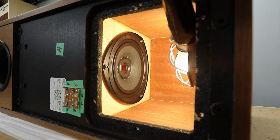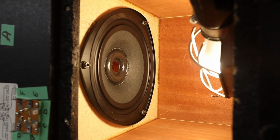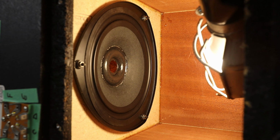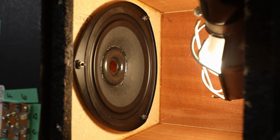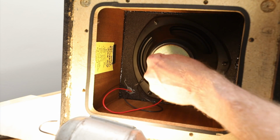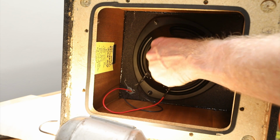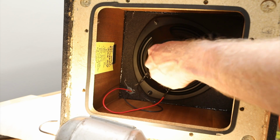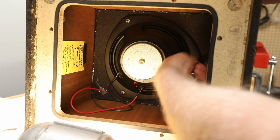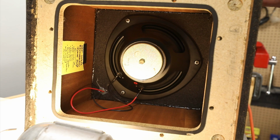Here's the upper woofer installed, the 3 washers and nuts, and the 10 mm center bolt that attaches to the top of the force cancelling alloy bar have been reinstalled. Notice how the sealer dried to a clear coat on the donut surround. After soldering the leads to the correct posts, the bottom woofer is back into its position. The 10 mm bolt goes through the center of the woofer and attaches to the bottom end of the force cancelling alloy bar. Reinstall the 3 nuts and washers on the lower woofer and tighten. Then put the insulation back in.